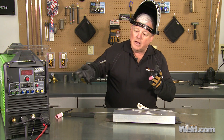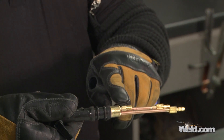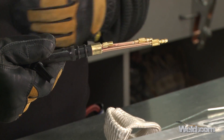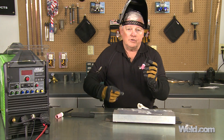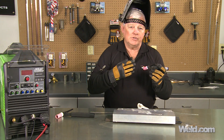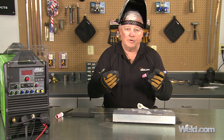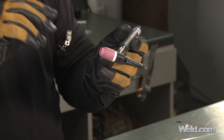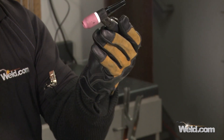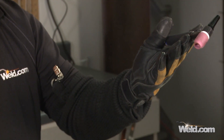You've got to add a water-cooler and all the connections to it. You've got to go to a water-cooled torch — and I'm going to pull the handle off this. You'll notice that there are three lines here, so you're going to have three cables and you'll have to put a sheath around them because they'll be like spaghetti. This is a 250 amp torch called a 20, a 20 style. Any time you have a 20 style, you can accept components that fit the 9 or the 20 — sometimes called a 2 series. You can put gas lenses, jumbo gas lenses, and Pyrex on it. There's every component you can think of for this torch. The neat thing is it's still small but 250 amps, so you never have to change the machine out again. Once you go water-cooled, this torch will never get hot — maybe a little warm, and that's about it.